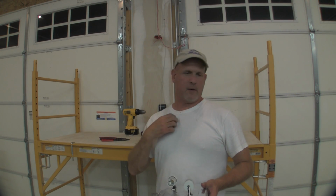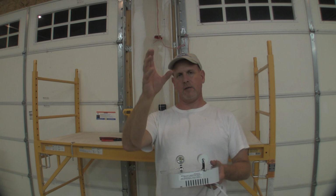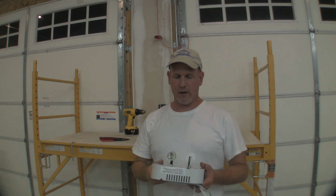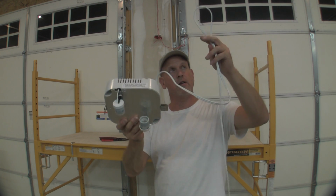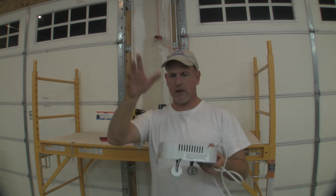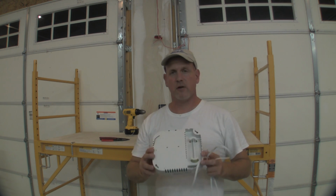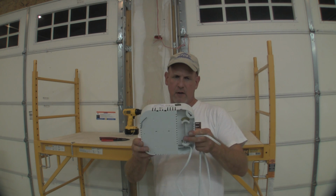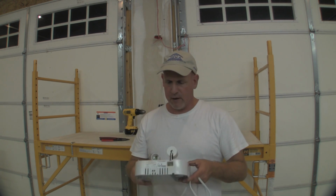Another really neat feature of this Liftmaster 8500 that I like a lot is, most traditional garage door openers have that motor that sits in the middle of the bay and has a light in it. Well, since this motor is against the wall, that wouldn't make a lot of sense, so they have this remote light. It plugs in, which is good because I've got an outlet there, and somehow the garage door opener sends a signal and tells this thing to cut on. So there's nothing to putting this up. It's just a couple of screws. I'll go up there and find one of my trusses and put a screw in that. Then I won't be able to hit another truss, so I'll have to use one of those drywall anchors. But it won't be a big deal. So I'll just go ahead and slap this thing up and have that much done.